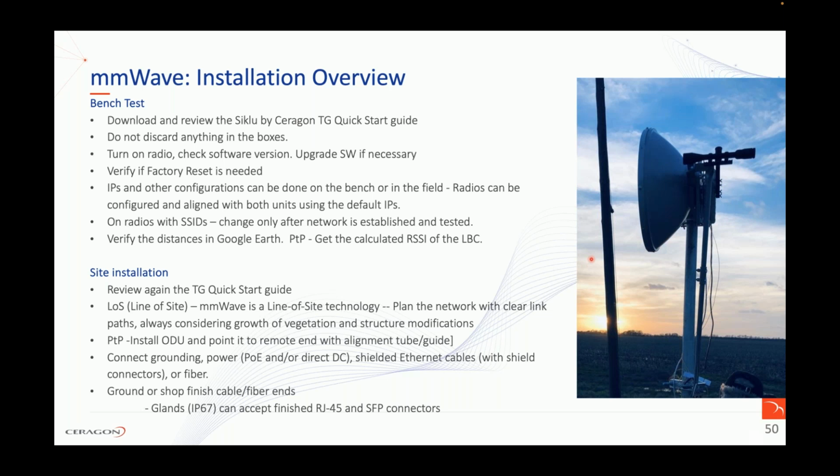The big advantage to IP addresses on the radios is that it allows you to IP directly into that radio so you know which radio you're talking to. Oftentimes we recommend during construction that you leave the default IP in there. That way, if somebody fat-fingers the new IP, they can always get in with the default. And then, right before sign off, you remove the default IPs.